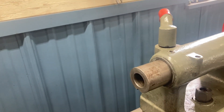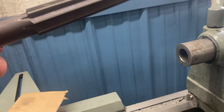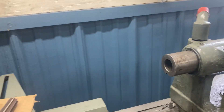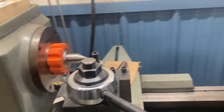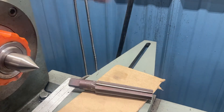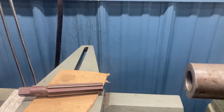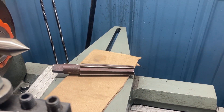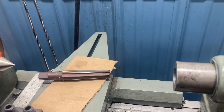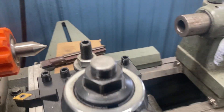What I've done is picked up a set of Morse Taper 3 reamers, and we're gonna use this reamer to clean up this hole. We're not looking to take a ton of material out, but we are looking to make an improvement. My setup is I have a dead center in the spindle that's gonna guide the reamer, and we're gonna use the tailstock quill to keep some pressure on the reamer — not a lot, because I'm only looking to take away the burrs and high spots to get the taper to function well again. We're gonna use some light hydraulic oil as a fluid to clear the chips.